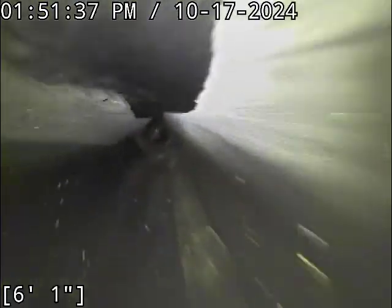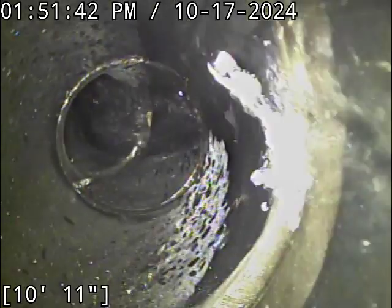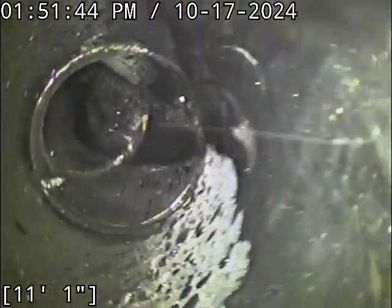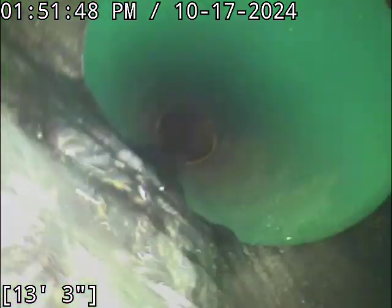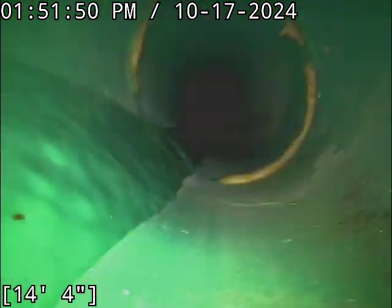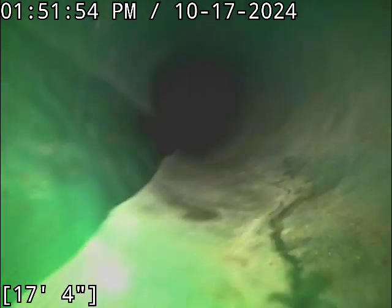There is a stamp in the concrete right where the driveway meets the road. It says S on it. That stands for sewer. That's right where the sewer line crosses into the road. You'll see that if you stand out in the street area here and face the house. You'll see an S, and you'll also see a D. The D stands for drain, or storm drain in this case.